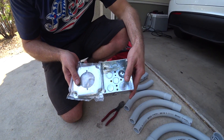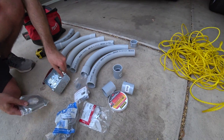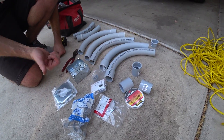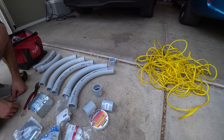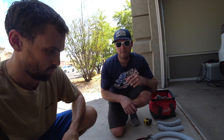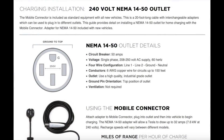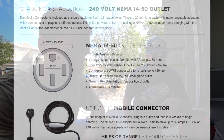That's exactly what electricians use for your dryer or any type of 220 plug. We bought regular stranded six-gauge wire because the specs recommend it for 50 amps. I like to pull just a little bit higher — you could run an eight, but I recommend a six, and I think the instructions recommend a six as well. I'll put those on the screen. You can also buy the six-gauge wire where it's all together, but since we're pulling it through conduit, it's cheaper to buy it stranded.